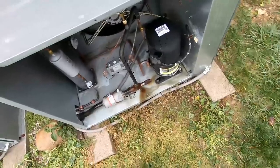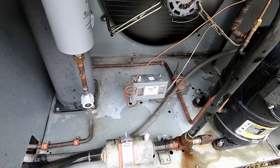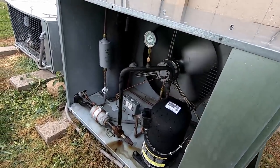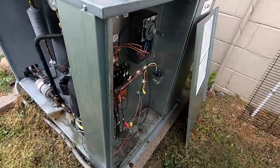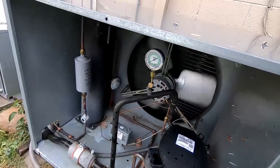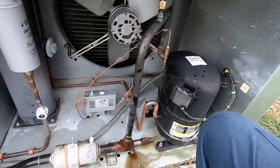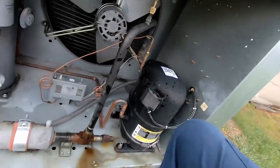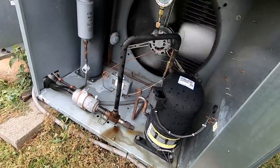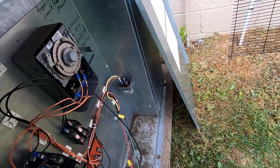That clock is really hard to turn. We've got this looped a little bit better — they're spaced out. No vibration. We've got this coming on at about 23-24 pounds. It can get down to negative 10 sometimes here, sometimes a little colder, but it really depends. This is running on R-404A. I can feel some binding in this thing, so we're going to replace that clock. One little turn and it goes almost down to a negative, a little tenth of a turn and it goes the other way — there it goes back on.